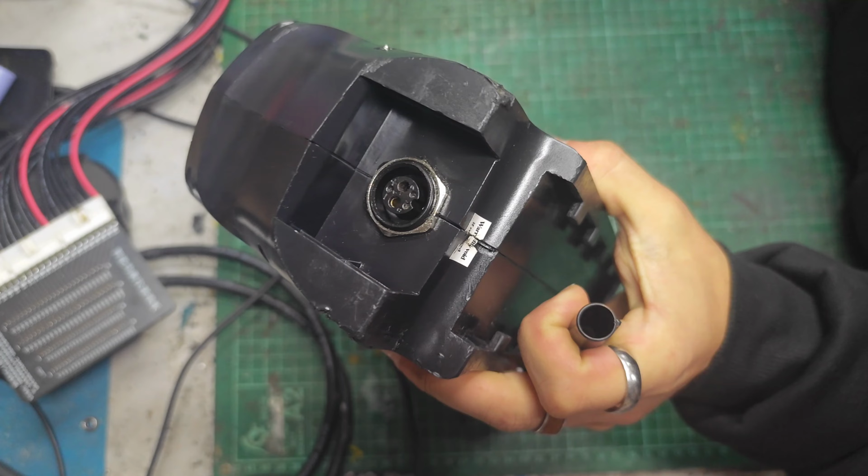What I've got in today is this, it's a Dillinger e-bike battery. We've got 48 volt, 11.6 amp hour. It's one of these, I think this is a tiger shark or a dolphin or something like that they call it. It's got one of those slides on and off. On-off button here. Indicator lights here. Charge port there, USB port there, fuse underneath here, discharge port here, which we'll get to, and then a key barrel there.